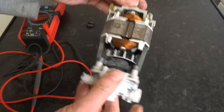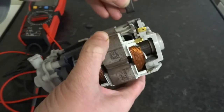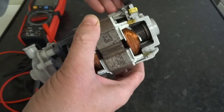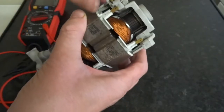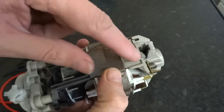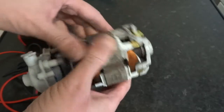Basically to test them, if you have a look, the spring contacts the electrical contactor for the winding, and then that passes it through this end of the spring into the brushes and then obviously through the commutator. So by having that clip there, there is no electrical contact from the windings through the commutator.